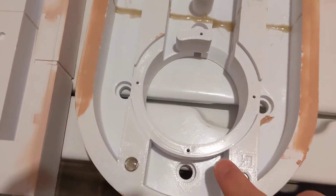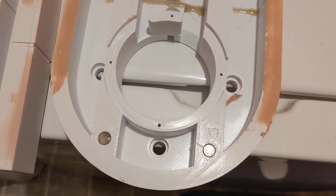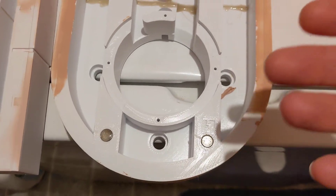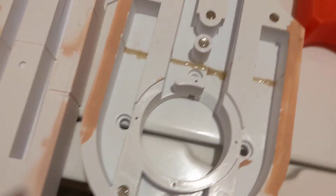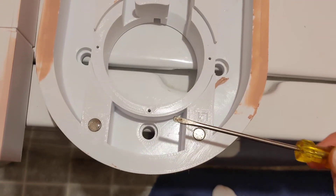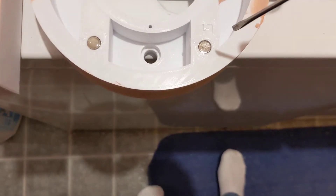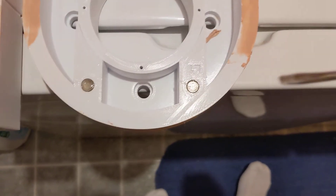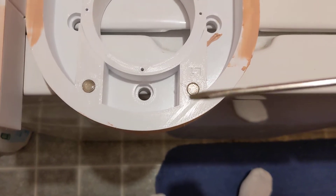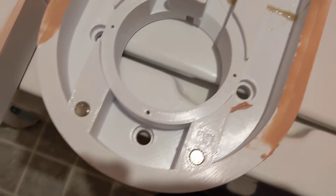Then push the magnet in, which gets the gloves all covered in epoxy. So you do a couple of them and your glove is covered with epoxy, and then you use another finger — and then I thought, well, that was kind of a dumb idea. Pretty much as dumb as using a screwdriver, because if you use a screwdriver, the magnet is going to stick to it. So when you pull the screwdriver away, it's going to lift the magnet out of the hole. You really want it bottomed out so you can get some epoxy on top to help hold it in place, because they are very strong magnets.